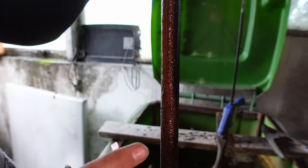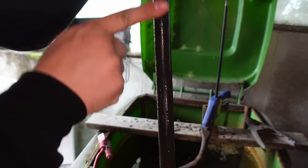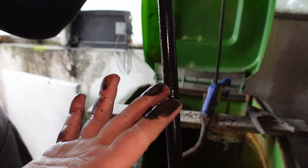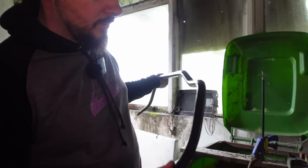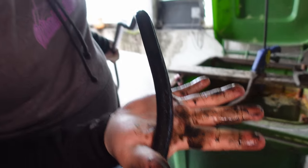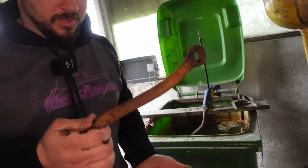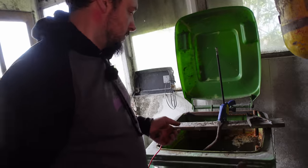Let's have a look. Look — there's the rust. It just wiped away, nice fresh metal underneath. Considering you didn't have to touch these, you just let it do its thing — it's such an efficient way of doing it. Any heavier rust this side — the bigger, heavier rust — you can see it coming off. It's coming off at the molecular level. It's completely stripped of the big rust. We'll have to give it a light wire brush.